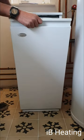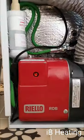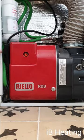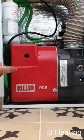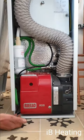To reset the burner, remove the cover. This would be much the same on any oil burner — Riellos and other makes as well. They've all got a red LED button. It's illuminating red, which indicates it needs a reset. Simply push the red button and you should hear the burner start. If everything's good, the burner will fire up.